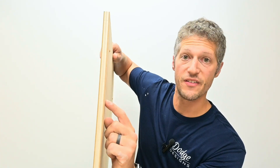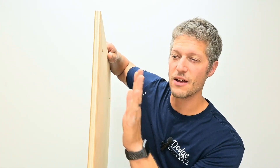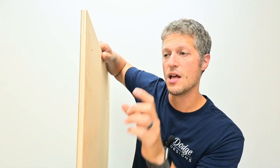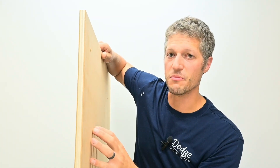Finally, the shelves themselves. I'd probably use a different material. I like the Pluma Ply and do use it for shelves, but it's really not quite as strong as a veneer core standard plywood that has surface veneers that are also a hardwood. The Pluma Ply has MDF on the outside and a veneer core interior. I'd probably go with one that has a stiffer exterior core, because when it comes to rigidity and flexure, the outside veneers are very, very important. So although this isn't the easiest method, it's definitely the strongest. Guys, if you're interested in more content like this, please give this video a thumbs up, consider hitting that subscribe button, and hopefully I'll see you on the next one.